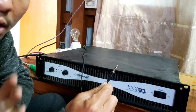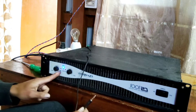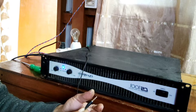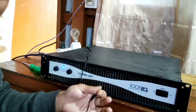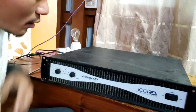Looking at the back of the amplifier, it has two input terminals — one for the left and one for the right. I'll turn on the system. We have LEDs here: this is the power-on indicator LED, and this other LED indicates an incoming signal. I'll touch the end of this terminal to test it. There is no indication here. This means that signal is not going through the amplifier for processing and amplification, so it has an input problem.